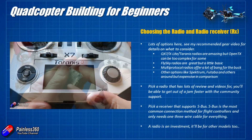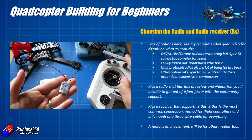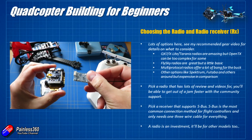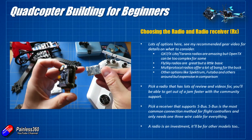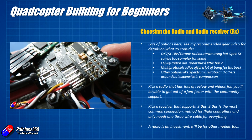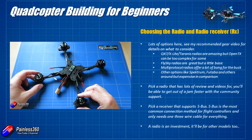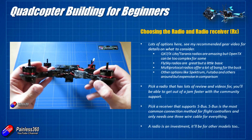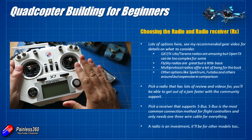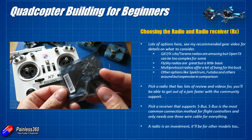Next, let's talk about the receiver. The receiver is the bit of technology inside the quadcopter that listens to the radio. Moving the sticks and switches on the radio tells the model how you want to fly, and the receiver transforms those signals into something the flight controller can understand. I would always use S-Bus these days to connect the receiver to the flight controller — it only requires three little cables to be soldered, supports up to 16 channels, and is nice and quick. There's also i-Bus, which is FlySky's version of S-Bus. I'm going to use a QX7 radio with one of the really small FrSky receivers — probably an XM Plus — which will fit nicely into the model without adding much weight.